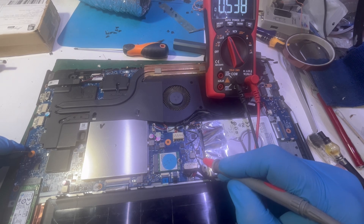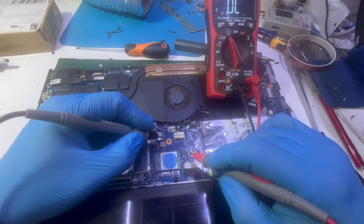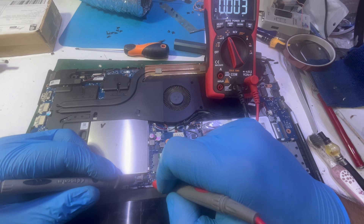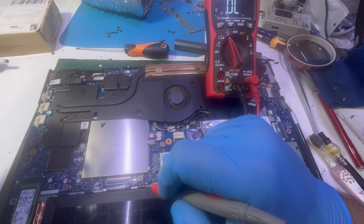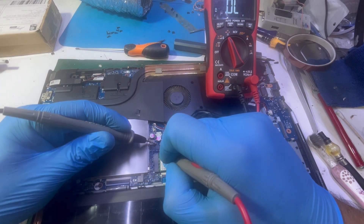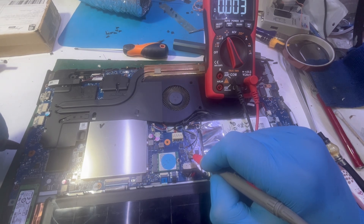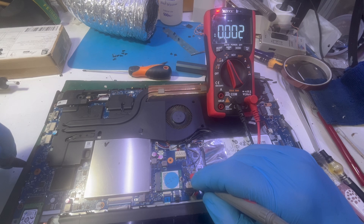All coils are good. But on the second MOSFET I'm seeing something like a short — yeah, the main power rail appears to be shorted. But does it have a real short or not? The main power rail is shorted but it does have some resistance — it's reading 0.02 ohms, which I don't like.